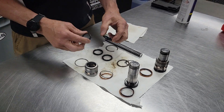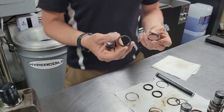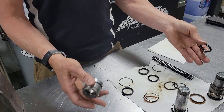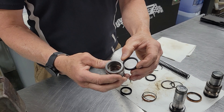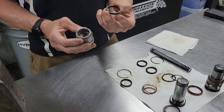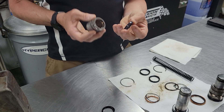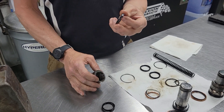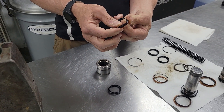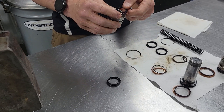There are two pressure seals that ride inside of the bearing. One is pink in color, the other one's black. You'll be able to find these by part number when you're looking at your blowup — I suggest you print that off the internet and have it in front of you. The black one goes up in the assembly toward the circlip. The pink one goes down in the bottom. I suggest if you haven't done this before, start with the bottom one first because these are tricky to put in. As you put them in, they fit very, very tight — one section of it wants to roll, so you'll get it in as best you can and then keep working it with your finger to get it to roll and orient properly.